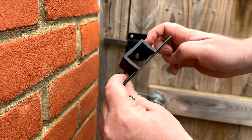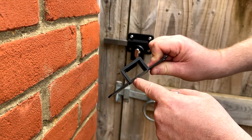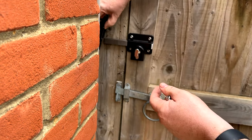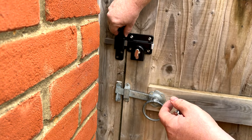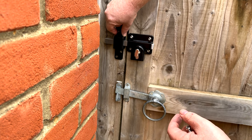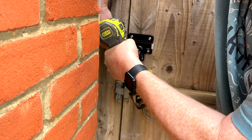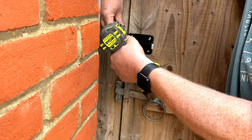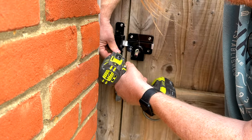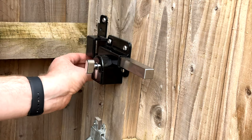The thing to note about this keeper is that it's got a little ramp in here — I guess that's to stop things from rattling — and it has a profile that's proud at the front. So if I mount this too close to the edge, that's going to get in the way when the gate opens. I'm going to use a packer behind the plate.